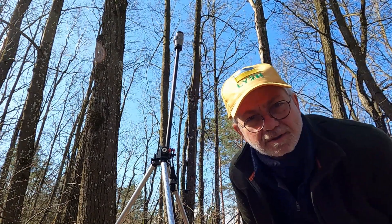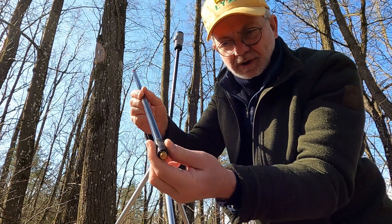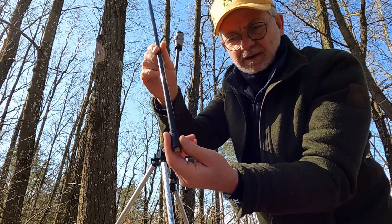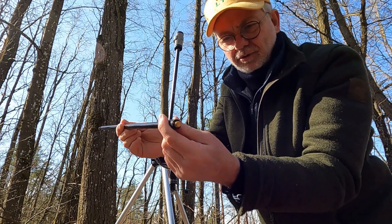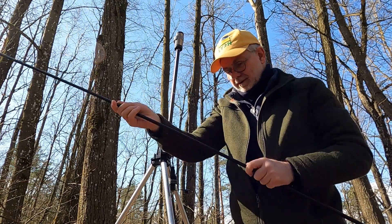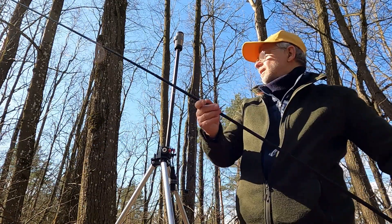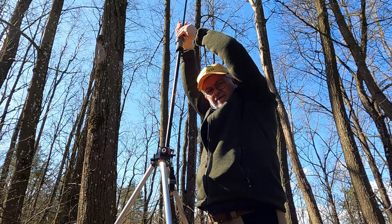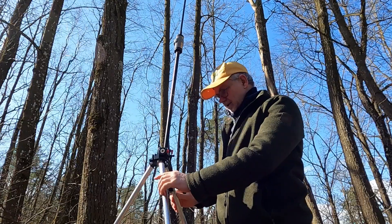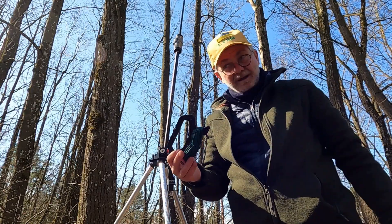The coil is in place. For this longer whip, I also bought a very useful reinforcement sleeve — it just screws on and makes this part of the antenna more firm and sturdy in case it vibrates in the wind. First you need to extend the whip, otherwise it won't be possible to reach the top. All right, that's a very nice and long whip. If it's very windy it's even more complicated; in those cases the quick-release mount is worthwhile to use. And that's actually done.